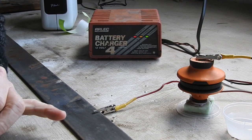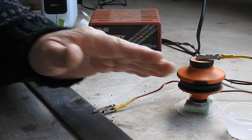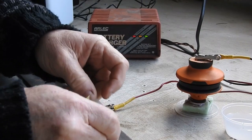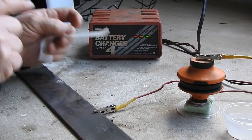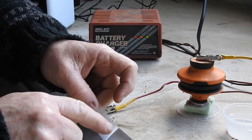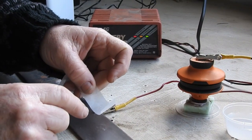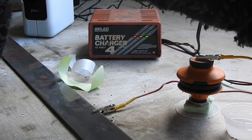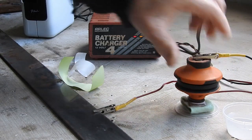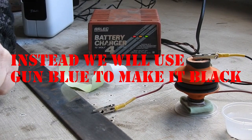The biggest thing most people have a hassle with is getting a transfer that will prevent the etching taking place. A stencil like this acts as a mask — specifically designed for etching — so it takes so much time off your hands just by printing out your design. It's got its own software; import whatever you want and put it onto the tape. I've also got a 24 volt AC transformer, because DC etches into the steel but won't make it black. Adding the 24 volts AC afterwards will make it black.